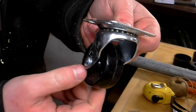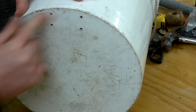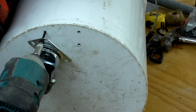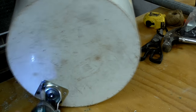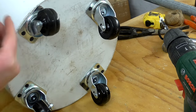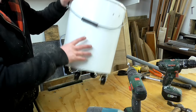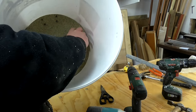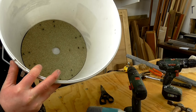With the piece of wood in the bottom of the bucket, I added four casters to the bottom. I drilled pilot holes through the plastic, then added screws through the plastic and the wood, holding the wood in place from the other side. All four casters are now added. I was worried about stability since the wheels are quite close together, but I think it'll be fine. The screws protrude through the wood, which gives the concrete something to grip onto.